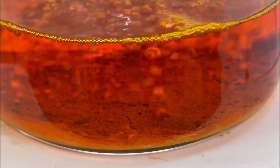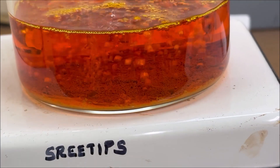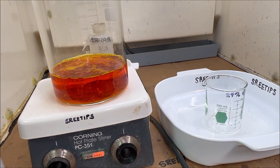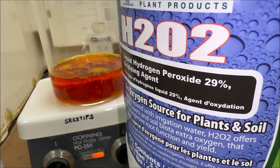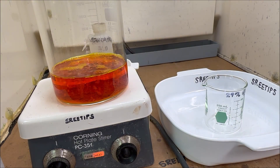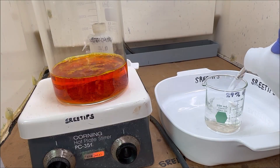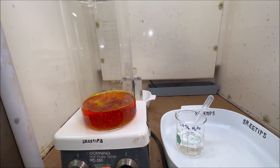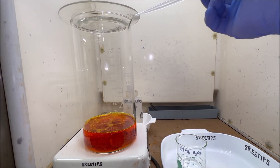I've been boiling in the hydrochloric acid for about 10 minutes. Now we're going to try - there's some insoluble stuff in there - we're going to add some of our hydrogen peroxide, 29% hydrogen peroxide, and see if we can get that insoluble material to go into solution. Our solution is very hot so we want to do this carefully, adding it in just drips at a time.